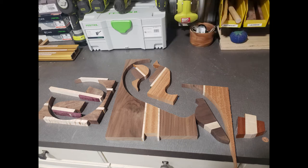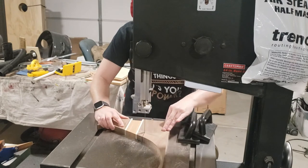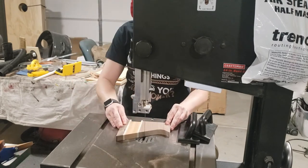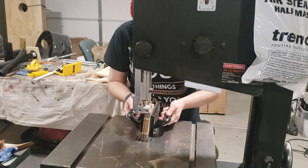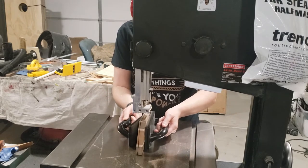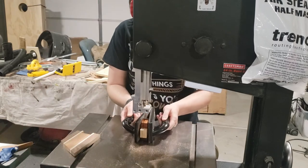I just need to get the thickness of the wood down to a good size for jewelry, which tends to be about anywhere from an eighth of an inch to a quarter of an inch. So I'm just resawing this, and I just cut off anything that was solid wood — I want pieces that have different species glued in so it gives my jewelry some dimension.